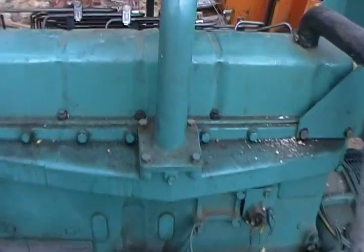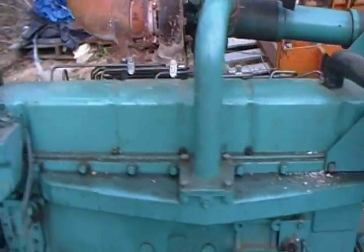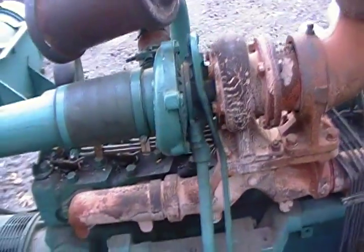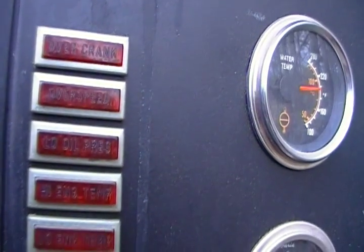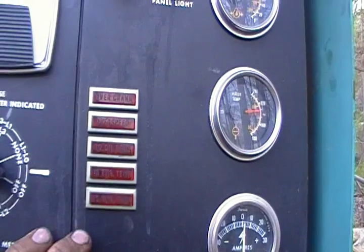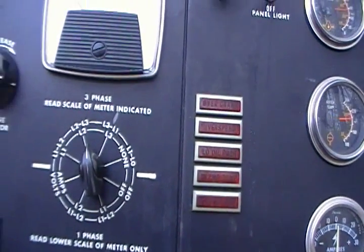It only came back this past Thursday, so I really don't know. I suppose the first thing I'll do is take the valve cover off, see what the rockers look like — see if there's any signs in the upper end that it was seized. Even if the oil was at the ADD level, it shouldn't have seized. Let's see what alarms it has: over-crank, over-speed, low oil pressure, high temperature, and low temperature alarm. I wonder if it has an emergency shutdown on low oil pressure.